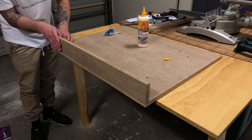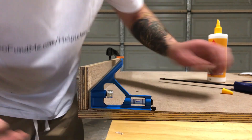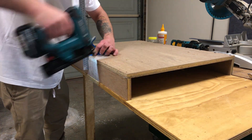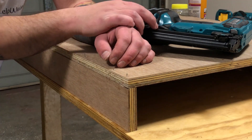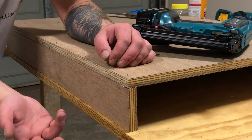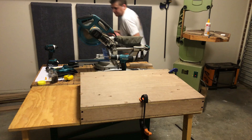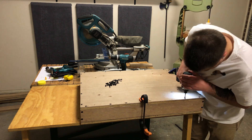A little tip when applying glue: give your part a little wiggle, it helps it suck to the timber. I was fairly disappointed with this nail gun — this is only hardwood plywood, it's not solid hardwood. I am using the longest nails that this unit can carry but still it didn't drive them all the way through. I'm gonna have to come back with a hammer. It's fair to say I'm a little paranoid that the weight of this thing is going to collapse on itself, so I've put in a lot more screws than necessary.